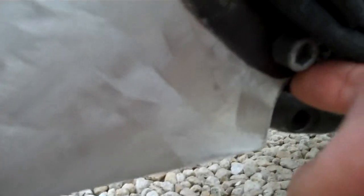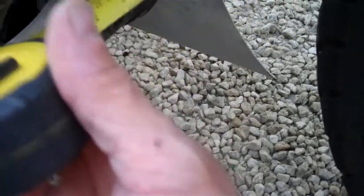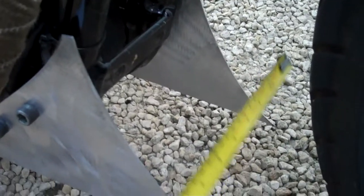Okay, phase two, got this on now. On this particular side I've had to cut back significantly here, because this thick part of the frame - this chunky knuckle on the frame - just kept bending this corner out, so I've cut that right back, give it a nice little edge, and you've still got plenty of meat in there to hold it on. So these are now bolted absolutely straight and absolutely tight. I've also lapped the remaining powder coat off. So next task is just to measure this front - measure across there and up to there - and get myself a template cut for that front, and then get that sawn out nice and straight. Really important it's dead straight.